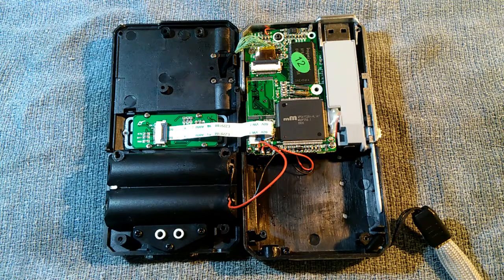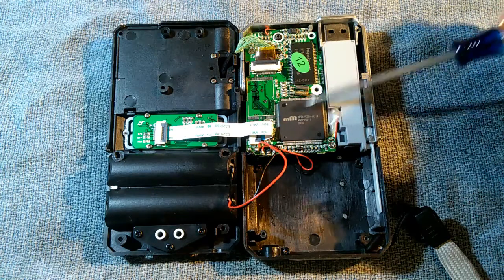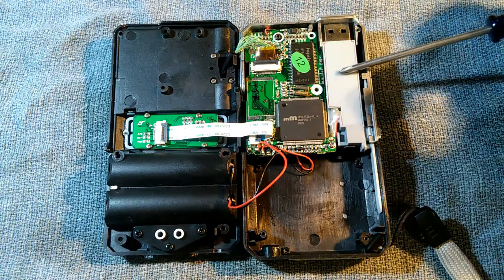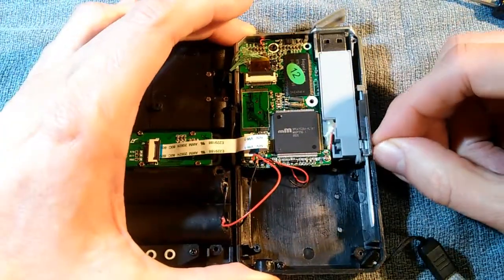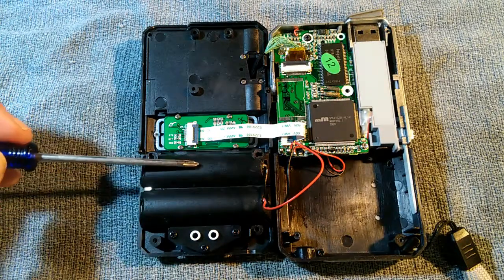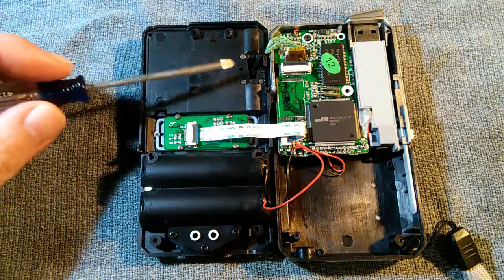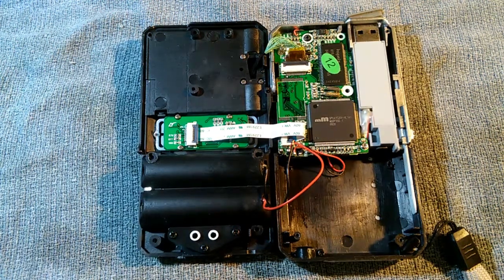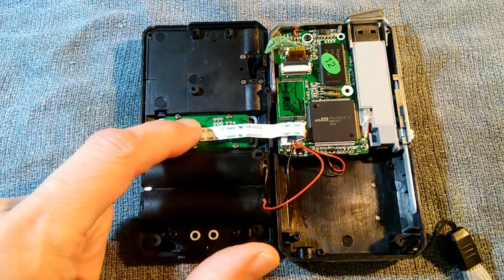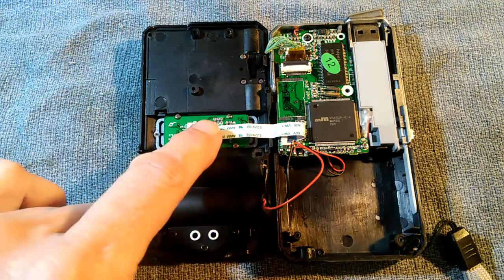Now that it's opened we can see what it's made of. There's a main circuit board right here which has some sort of a CPU on it and a memory chip. There's this USB port — it slides up like that. Over here we have the containers for the two AA batteries. This is the button board with a cable to the main board, and behind this piece of plastic is the LED board, also with a cable to the main board. It isn't obvious why the device isn't working — there's no obvious battery leakage on the circuit boards. One thing I've found with experience is sometimes the connectors can get oxidized and you can develop a problem. This just happens with age, so I'm going to pull these connectors off and maybe polish them up a little bit.